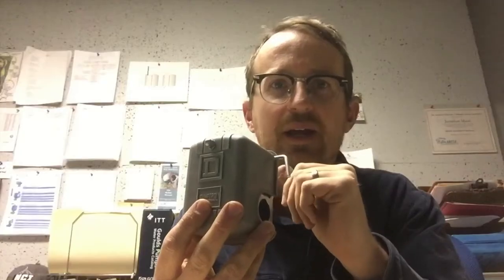So if you're running multiple things at once or if you have something that uses a lot of water, this pressure switch is designed to activate at a low pressure threshold. The pressure switches with this toggle switch on it will usually turn on at 30 psi, but this toggle switch will activate at 12 psi. So if you have an appliance that uses a lot of water, that pressure will start to drop, and before the pump can kick on at 30 psi, the pressure drops off too quickly and if it hits 12 psi, it will cut the pressure switch off. So even though you have water in your cistern or your spring tank, you can still trigger this little low-level cutoff.